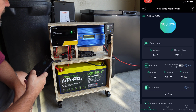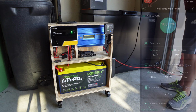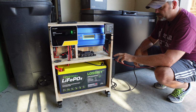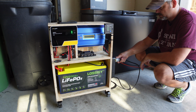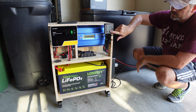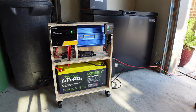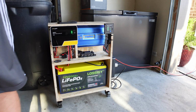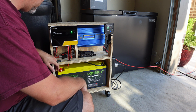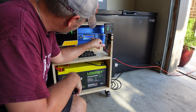So now the next step is to actually connect the chest freezer to this battery unit, and we're just gonna keep it running. And we're gonna plug this cooler directly into my little watt meter type thing that is connected directly to my inverter. There we go. Turn on the inverter. Chest freezer is on, and it is a swampy 95 degrees in the garage right now with this Texas humidity. Everything's running fine. My volts actually jumped up a little bit to 13.75. Inverter's running fine, and that's showing 13.7 volts, output 120 volts.